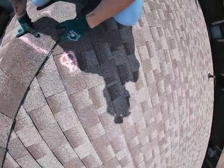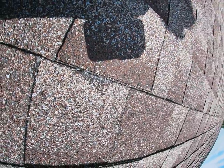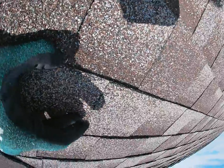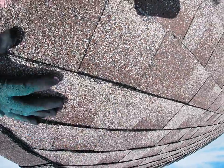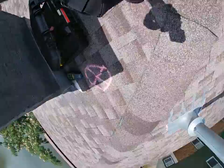First problem, starting here all across your roofing system: that shiny substance that looks like spider webs — what it actually is, is the fiberglass back matting of the shingle. You can see here this is completely exposed. Fiberglass is moisture absorbent, and when shingles lose their granules, they soak water up like a sponge.